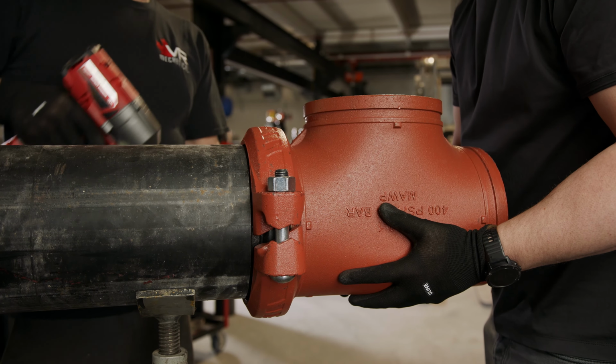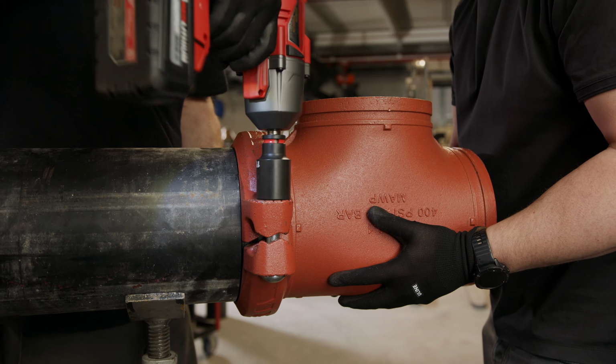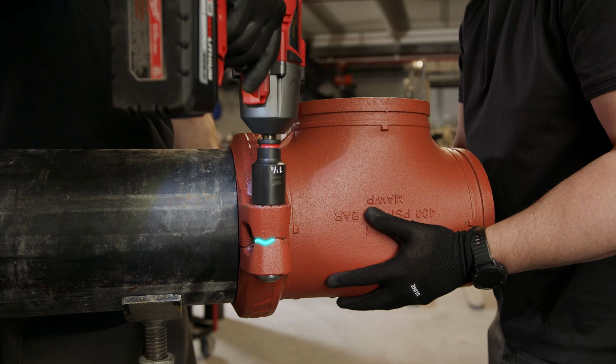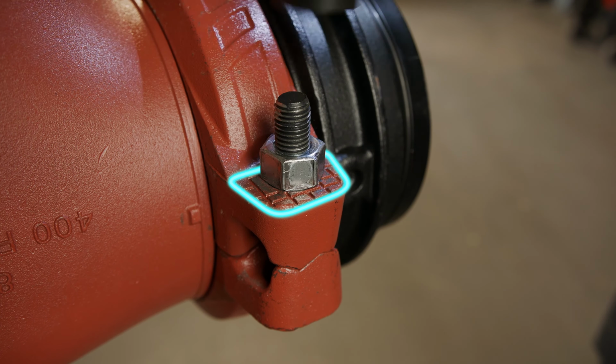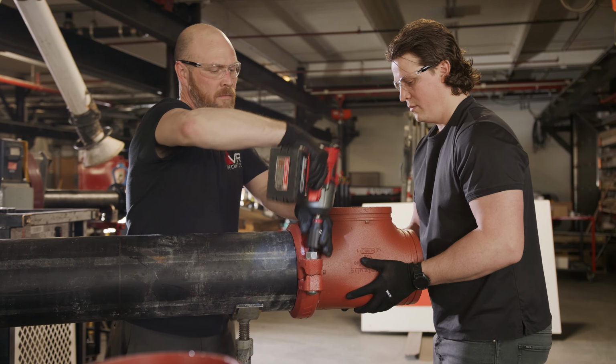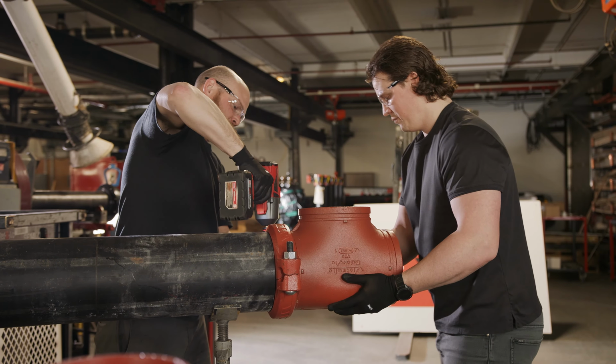The new 107V is very easy to indicate whether it's been installed correctly. It has very key visual aspects to it that allow you to know that it's fully bolted down. The new couplings give me confidence because they have stops on them so you don't over torque them. They have a stopping mechanism on it, and you know you're not doing one side up tighter than the other. With the 107V, you eliminate that. You can fully torque each bolt, eliminating that back off.